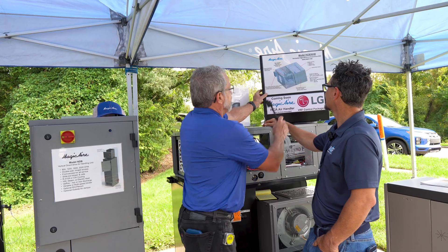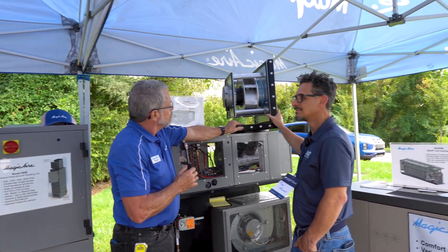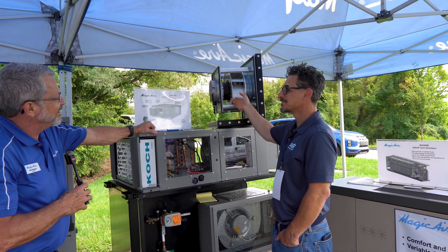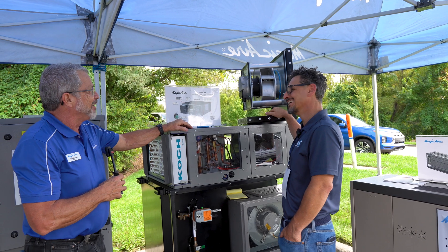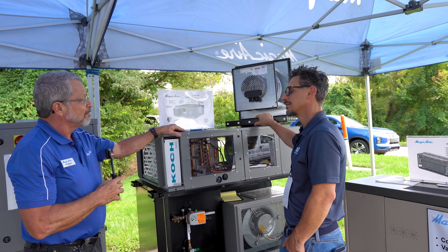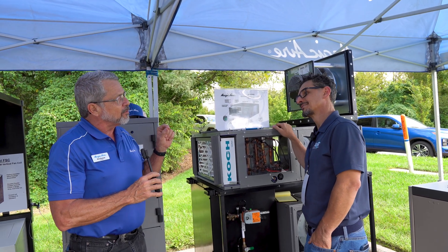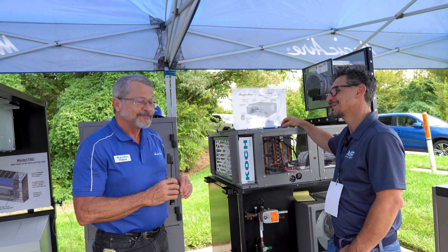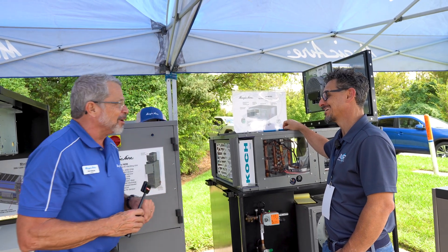The larger units will use a plenum fan. We're using more and more of these plenum fans to get the static that you need for an air handling unit and still get variable speed. They spin this way — not the other direction, which could be a good cheese grater. This has got the EC motor, which is a built-in variable speed very high efficiency motor. You can buy it with a potentiometer for testing and balancing, but even better is to drive it with a signal from the building automation system so you get only as much as you need. With a belt drive fan you'd have to calculate sheaves to change the speed — a lot of work.